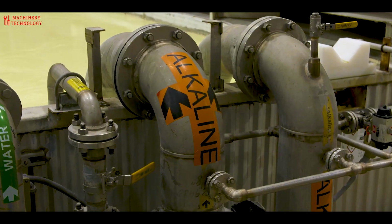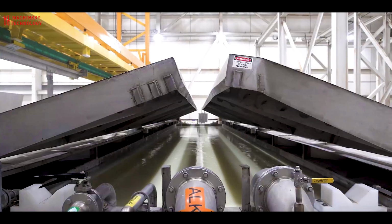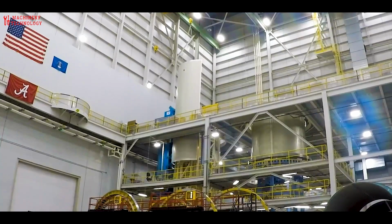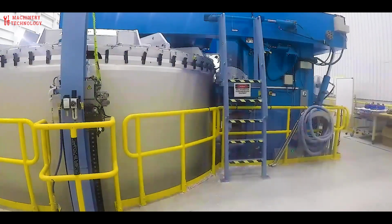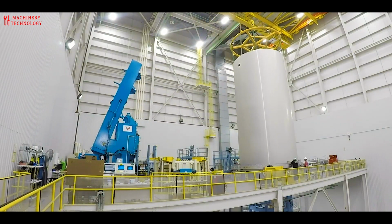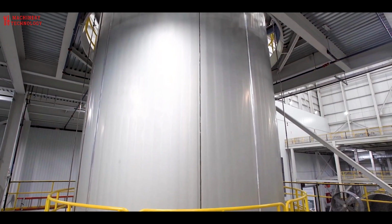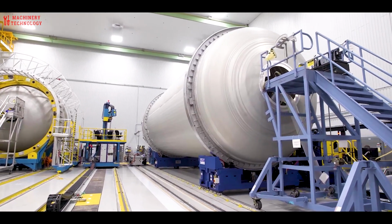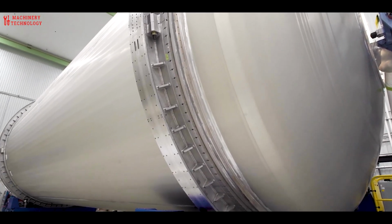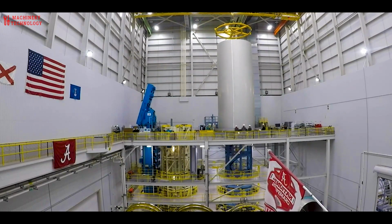For the liquid methane tank, panels are assembled and joined together using friction stir welding. Unlike traditional welding, where filler material is used to join components, friction stir welding uses a head to stir the metal of the 2 panels together as it moves down the seam. The resulting joint is stronger and produces a lighter weight, higher performing tank. The processes are repeated to create a liquid oxygen tank stack, followed by attaching domes to complete the tanks. Friction stir welding is then used to join the 2 propellant tanks, completing the Vulcan booster, and production continues